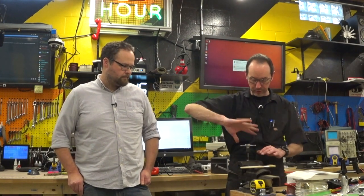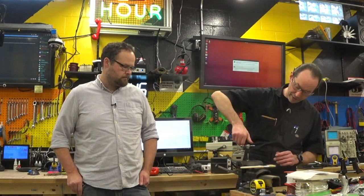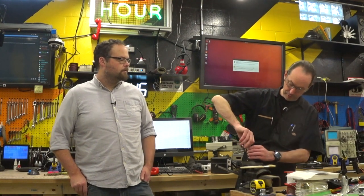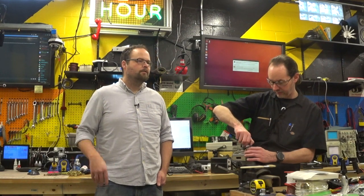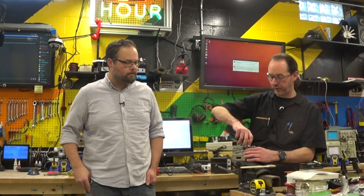You'll notice I'm doing it with just fingertip pressure, super light pressure. Oh wow, that's thin. We're already through. I'm going to go until I feel the resistance of kissing the other side. Do you normally go forward 3, back 1? Yep, forward 3, back 1. You want to break chips.